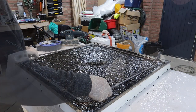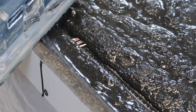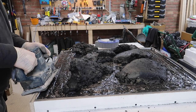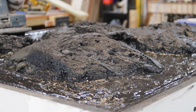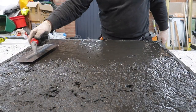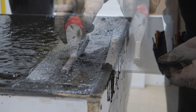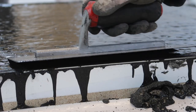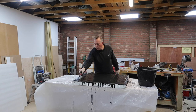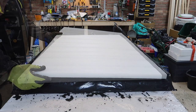With the mould just over a half full, I place my rebar into the centre of the pour and cover it by using the vibrating sander to liquefy the concrete. Once filled, I screed across the top using a straight piece of timber and float off, filling any holes as I go. Cover with polythene and wrap to keep the moisture and the heat in, which is needed for concrete to be cured without cracking.